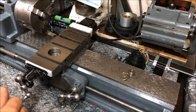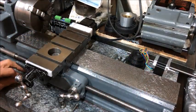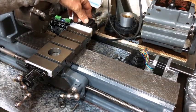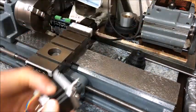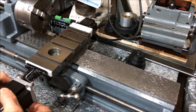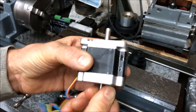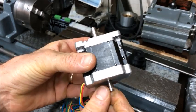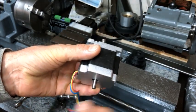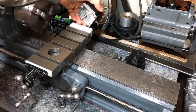Moving to the x-axis, I have done the same as on my Super 7 — mounted it to the rear of the cross slide. I've seen other designs that use the front, directly as an extension, which is possible if you have a shaft-through stepper so you can mount the handle there, but I don't like that, so I mounted it to the rear.